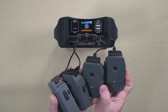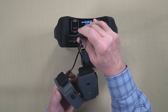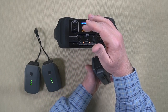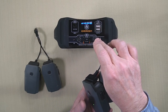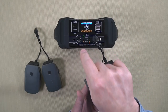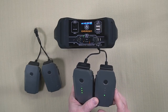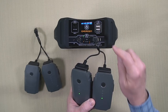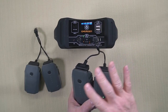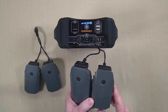What makes this even cooler is that since I'm charging my Mavic Pro batteries on here, a lot of times I fly with friends that fly different quads. Let's say I'm flying with somebody who's got a Phantom 4 — I can be charging my Mavic batteries on this port, change the other side to a four-cell battery setting, and plug in the connector for his Phantom 4 battery. That way, I charge my Mavic batteries while they charge their Phantom 4 batteries at the same time. And if we have phones or tablets to charge, I can plug them in the USB ports in addition. This is a very versatile charger that allows me to pretty much charge anything I'm bringing along for that afternoon.